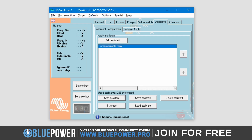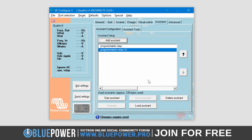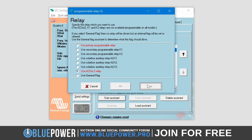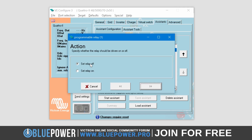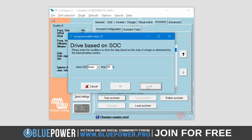The process of doing this is almost identical to what we just did for the on state. First, we need to add another assistant by again selecting Programmable Relay, then start the Relay as before in order to configure it. Select 'Use AC out 2 Relay' again. Then on the next menu, keep 'Set Relay off' instead of changing it to On. Select the State of Charge parameter again in the next menu while skipping past the Extra Drive option menu again. Lastly, we want to keep the State of Charge in its current 'lower than' state.